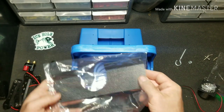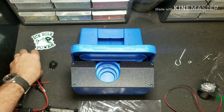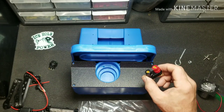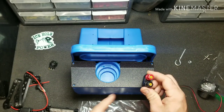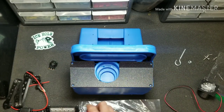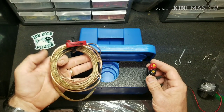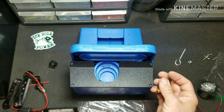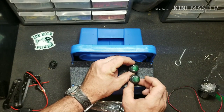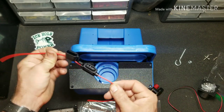We're going to open up our battery cover — it also includes hardware and sits right on the back like that. We're going to install our banana jacks, and while these are nice for charging, I'm going to wire it up so all you have to do is turn the switch on and it'll charge your battery — you don't have to monkey around removing this cover. They're also nice for backup power so you can run LED light strips with alligator clips on the end, clip on to positive and negative. Then it'll have a master switch and a regular switch for turning on the banana jacks, all protected by an inline fuse.